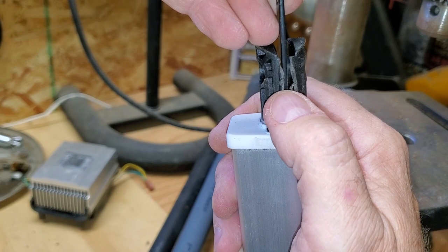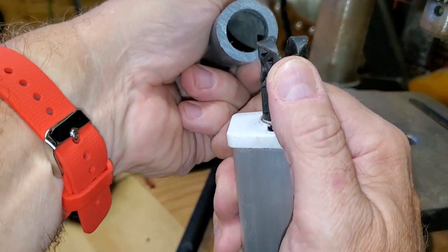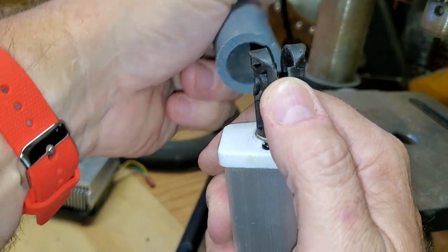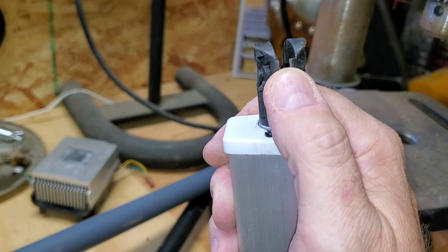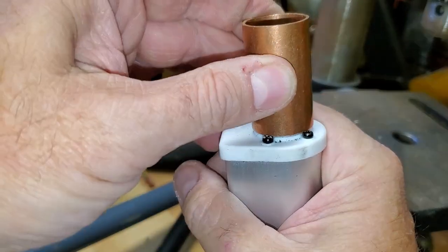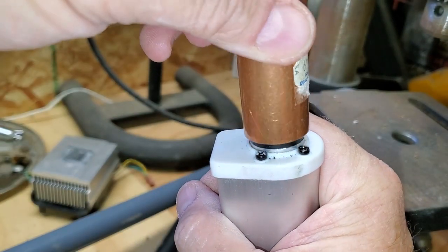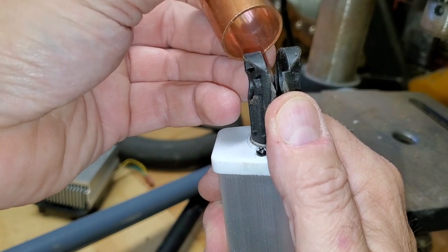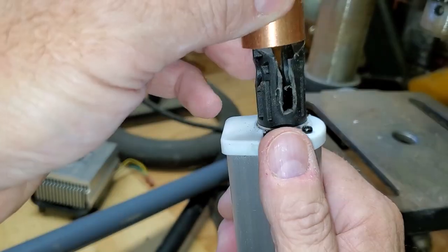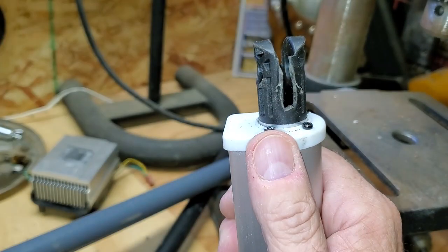And I think that steel is pretty thin steel. This plastic, I know I used it on my other chair. This works nice, but like I said, it's not the right size. I also found 3/4 inch copper tubing, and that fits pretty good. It's a little bit loose. Tighter the better, but you want to be able to put this on and then slide it down and then put the pin in. You don't want it too tight that you're fighting with it because you're inside your chair.